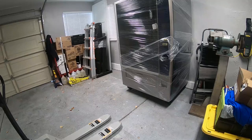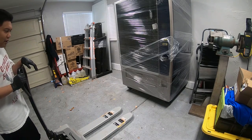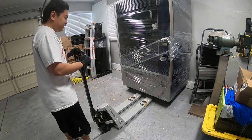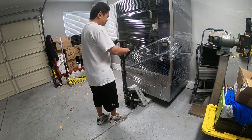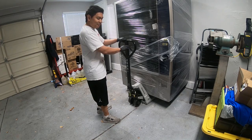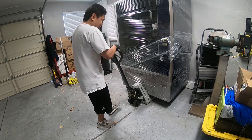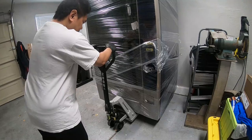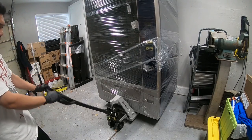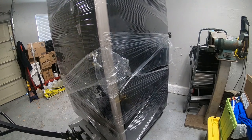It's very simple to use a pallet jack. Just make sure you're in the center of the machine, or try to get as centered as possible. There's a tab right here — you press it down and that locks the jack so you can pump it up. Then you just start pumping. When you're done pumping and you've got it to the right height, you just pull that lever. It's very easy and very lightweight.